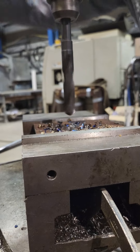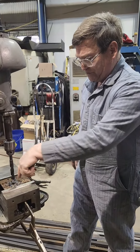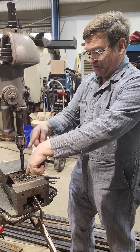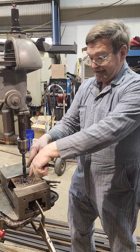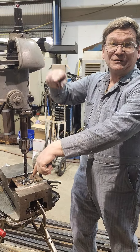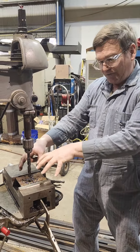That drill bit was a little off center, but you'd do that because you want to get down past a feature, so you've got a drill bit that's too long for its strength. You can't get in there with a center drill because your center drill would also be eight inches long or something. So you can come in with kind of a wonky setup.